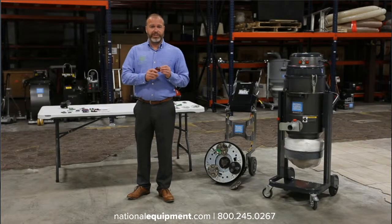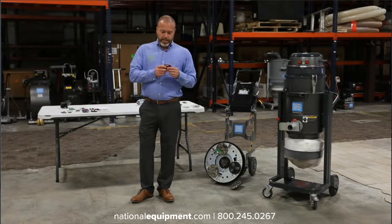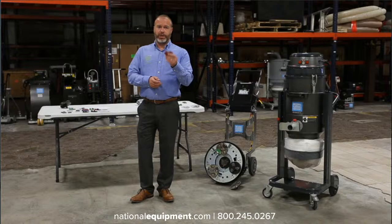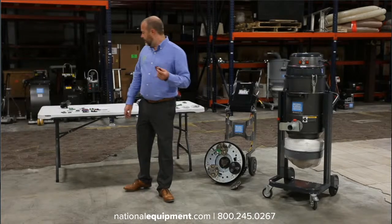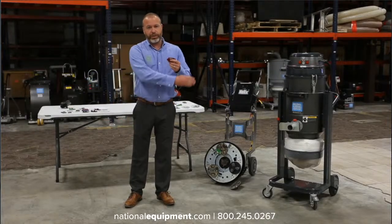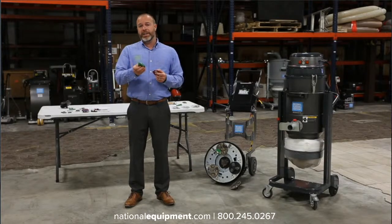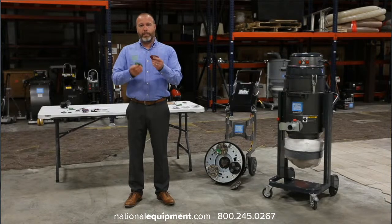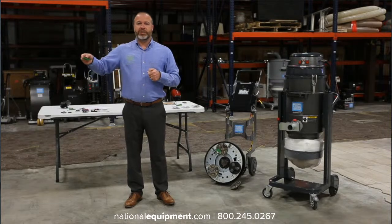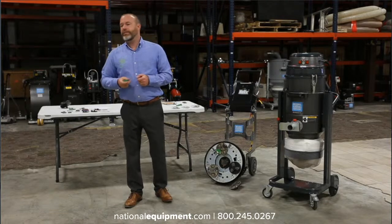If you're just breaking surface tension, you're just going to put some scratches in the floor to make your other diamonds more effective. But if you've got a really stubborn coating and you don't know what it is, using a super seg is a great way to test it out. You can start with a super seg and just do a quick pass over the coatings and cut into it, and then come back with your full bars or your half bar diamonds. And those can, in combo, make your full bars or half bar diamonds a lot more effective because you're able to actually catch into that coating and cut it off the floor more effectively.